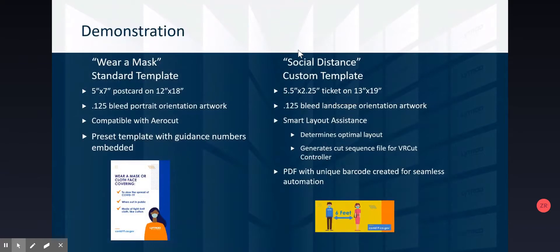Today we're going to be cutting two different jobs. We have two distinct types of templates: over 100 preset templates already in the imposition software out of the gate. Day one, install the software, and you get a library with over 100 jobs already, as well as all of those jobs already in the controller tool. These preset templates are based on popular cut sizes on popular U.S.-based paper sizes — five by seven postcards, four by six postcards, two by three and a half business cards. Those commonly cut jobs are already included, and that's the first job we're doing today.